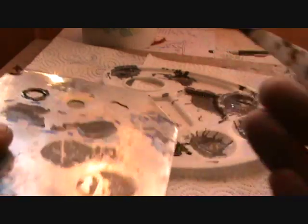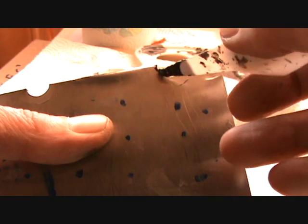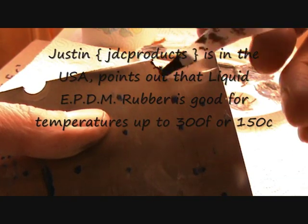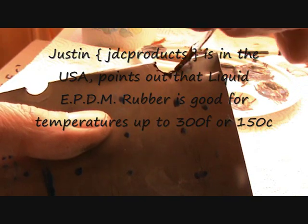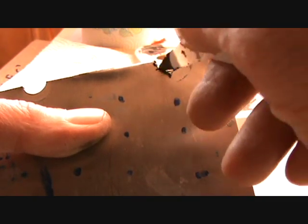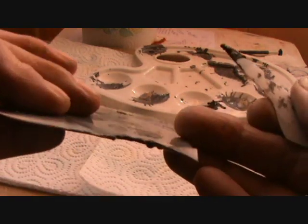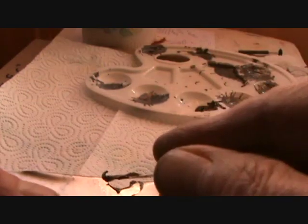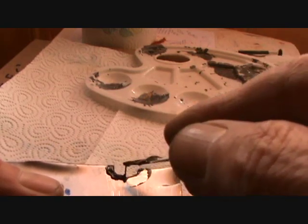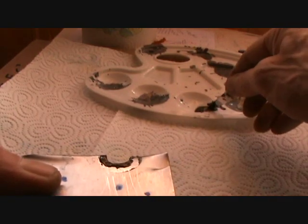What I have here at the moment is my small spatula. This is just at the moment to check the drying times and whether or not it'll pass an electric current when it's dry - because obviously we need it to act like an insulator. The RTV was very difficult to put on; you just couldn't stop it lumping up. It's quite important to get a thin coating on here.